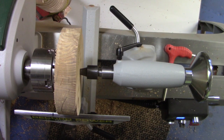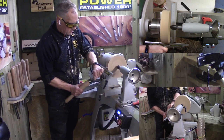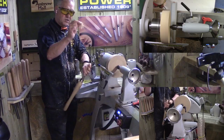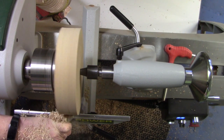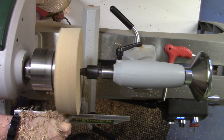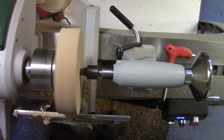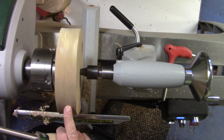To improve the cut, I hold the tool down on an angle and draw the cut, taking a very fine shaving. We'll draw it across — a very fine shearing cut with a long cut. You can see how you've improved the cut with that shear cut — you've taken away the torn grain.